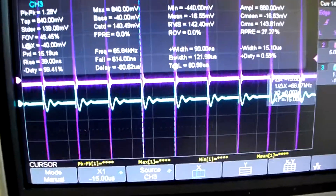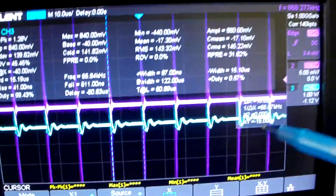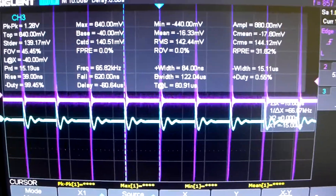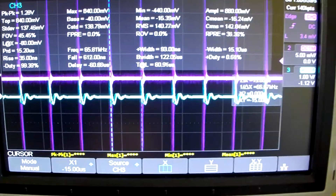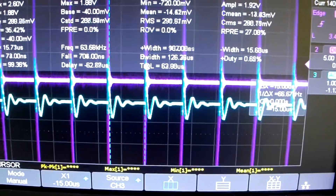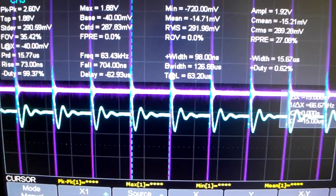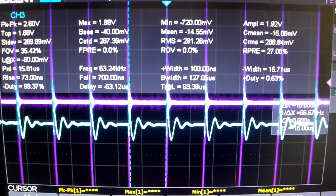In this part we see that it can oscillate by itself, but it is not at the resonant frequency. The frequency here is 66.67 kHz, whereas the resonant frequency we saw before was 290 kHz. This is when connected to the 100 pF capacitor. Going now to disconnect everything and connect to the 22 nF capacitor — the frequency is still the same and it is still oscillating. Maybe it's possible to make changes so the switching point is later. I am going to investigate it and if I find something I will add it to this movie.